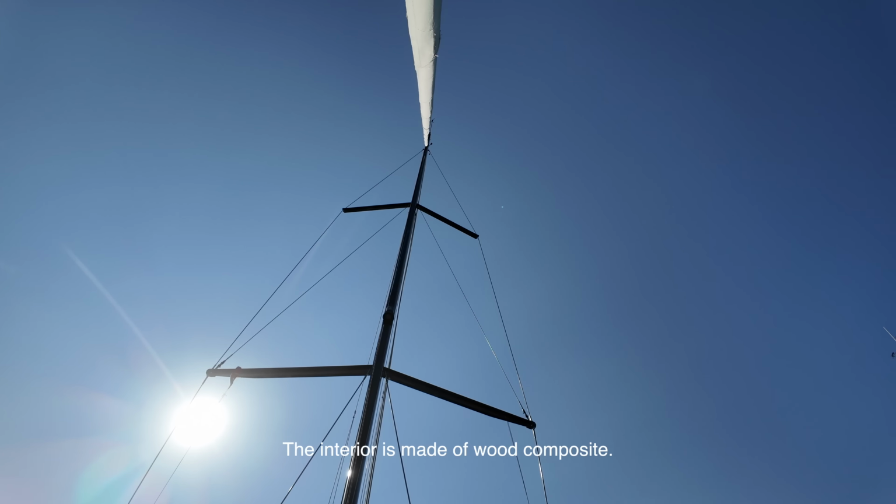So the plan for today is to apply that primer layer up here in the bow. And the reason we're doing that up here in the bow is just so we can laminate during daytime, and having that primer on makes that possible and a little bit easier, since it stops some of that off-gassing that you get from the wood when the temp is going up.